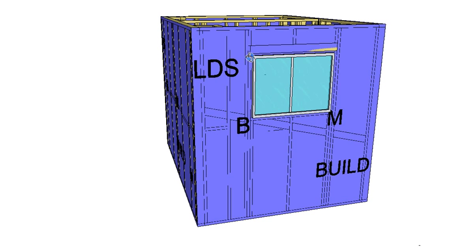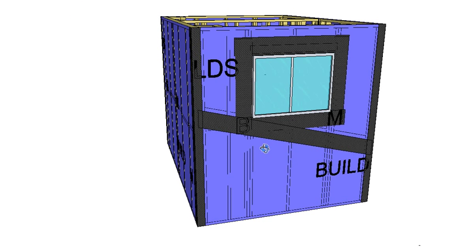It also, when you cut it around your windows, if you cut it a bit bigger than it needs to be, can help to do what we're going to do next, which is the flashing. So regardless, the code in Australia actually says that if you've got insulation, then you don't need flashing. So if you insulate, you don't need to do flashing, but personally I always do both anyway, just for precaution. You know, for the price of a roll of this polyethylene plastic flashing, it's going to save you a lot of money if you ever get a callback on the cladding. So I always put the flashing on as well.